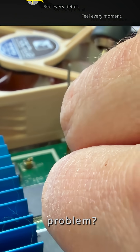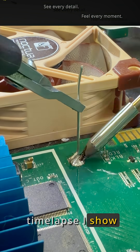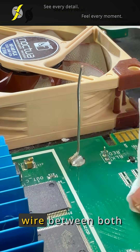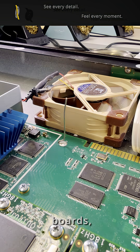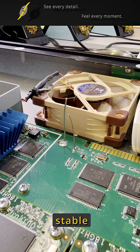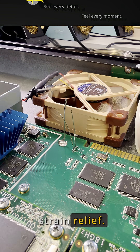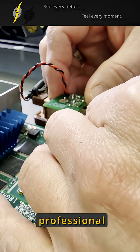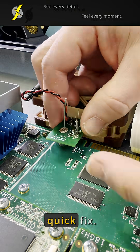And how do you solve this problem? In this time-lapse, I show how I fix it properly: a solid ground wire between both boards, refreshed power contacts, and a custom foam support block for stable positioning and strain relief. A long-term professional solution instead of a risky quick fix.